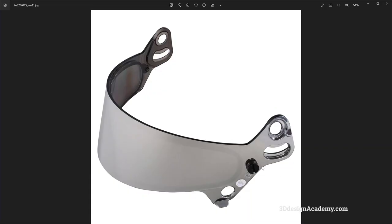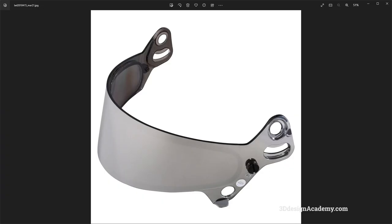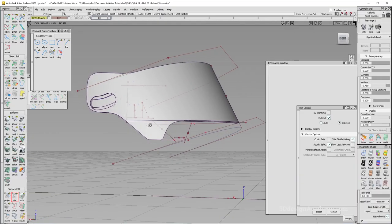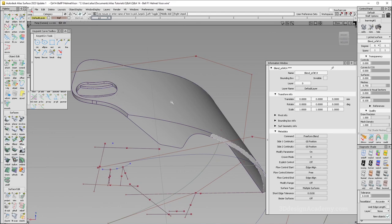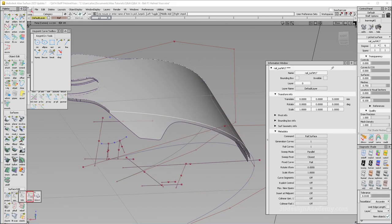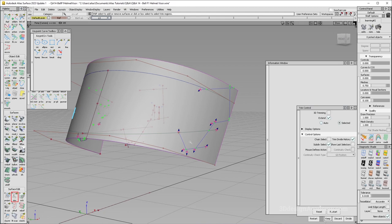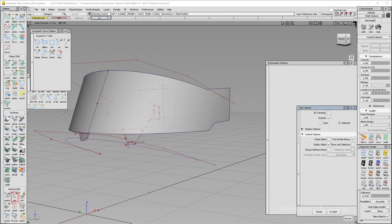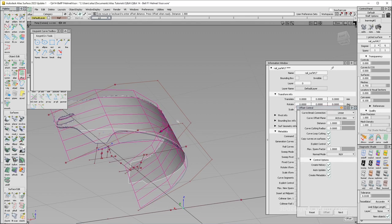This side — maybe the fillet is way too big. No, that's a different one. That doesn't really show. However, I still think the fillet is a little bit — maybe the canvas was a little bit off — but that's okay, I'll just use this one. That's it. However, I do need to make sure this goes across. I'm going to say untrim, delete the COS at the center, trim this one, and delete this one. I'm going to offset it — four mils, same thing.